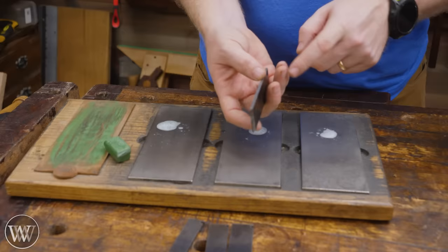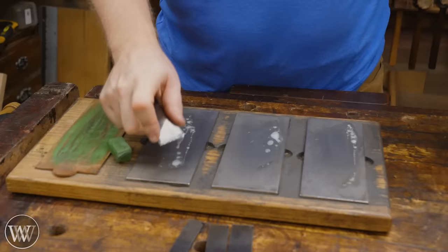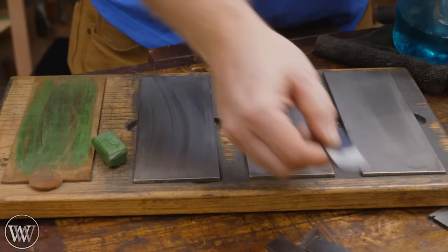Let's start off with a straight iron. It's going to be just like a chisel. I'm going to place it on there, lift it up until I set the bevel. Two fingers in the front, it's going to be resting on these fingers in the back. And I'm just going to freehand it. If you haven't gotten into freehand sharpening, I have several videos on how to do it and it's definitely worth your time. Once you can get freehand sharpening down, everything becomes much easier. After working it through the grits, we can work the burr off and strop it just like normal. And now we have an edge that is really ready to go.